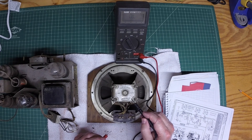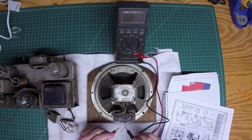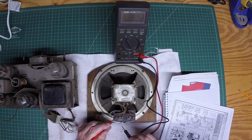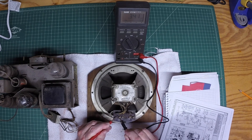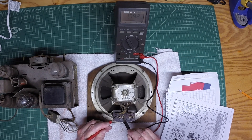Let's take a look at the field coil now and check it. My connection points are one, two, three, four, five. In this case, I'll be reading between points one and two. Looking at the schematic, I should read somewhere around 400 ohms, and I'm reading 341 ohms — hopefully that's showing up on camera. So that test is good. And then going from point number one to point number three — the field coil is actually tapped in this radio. On the schematic it looks like around 1500 ohms, and I'm reading about 1800 ohms. So I think we're good here.